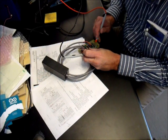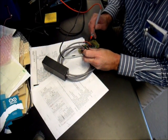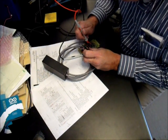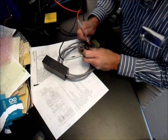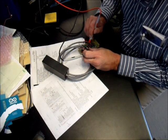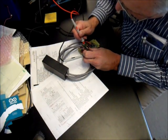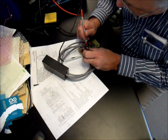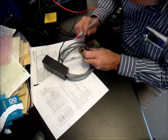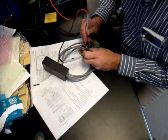I should also have connection over here to the ground pins, and not any of the others. As we go through this whole thing, and particularly on the power and ground, we want to make sure that we don't have a cross connection. We'll just absolutely verify everything out in the beginning.